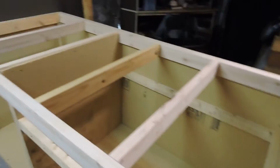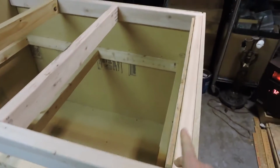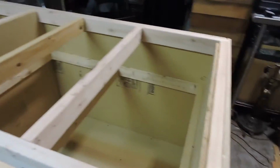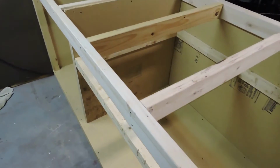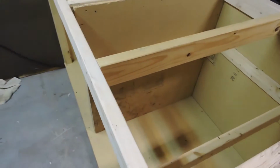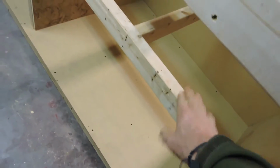This top that you see right here, this 2x4 top, is attached on 3 of its sides, really working so that I can't push this any direction. I can't whopper jaw this. It's not going to bow and bend. And not just because of the top. Right here, this really sealed the deal.